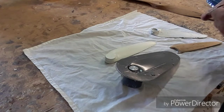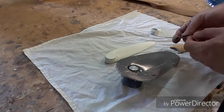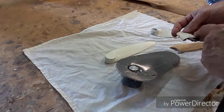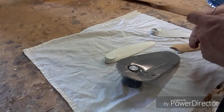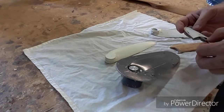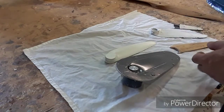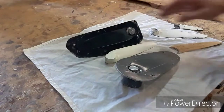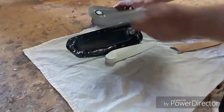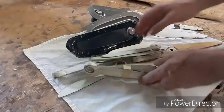It flew successfully with an electric motor. This is the layup of the hollow moulded propeller — it's just a couple of layers of 90g carbon with a very light carbon roving spar inside, all done in a wet layup. As you can see I've made several different moulds over the years with that type, and obviously had many failures.